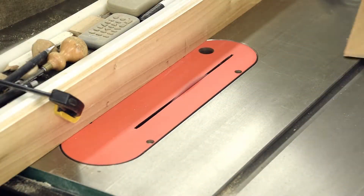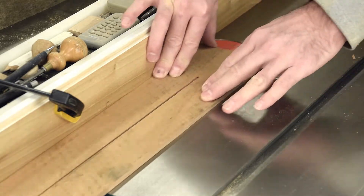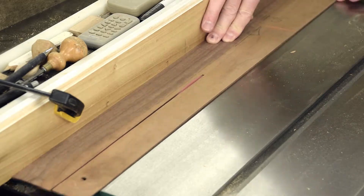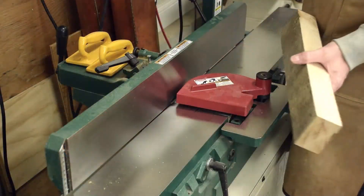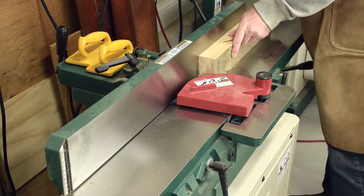The bookmark's main field is a three-quarter inch thick piece of maple that's about two inches wide. I'll need to rip two strips of butternut and two strips of walnut to rough out all the material needed for the glue-up. The center maple section will come from a leftover piece of eight-quarter plank — also from the scrap bin.